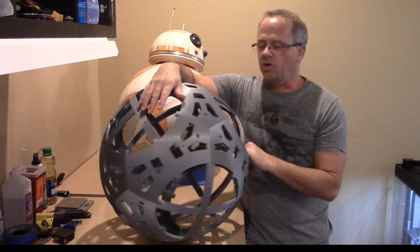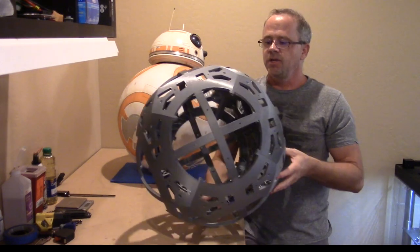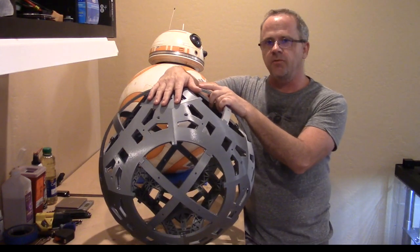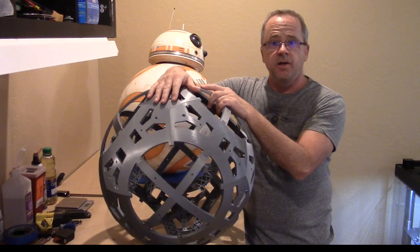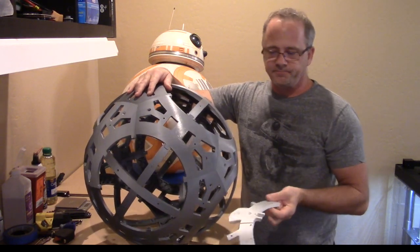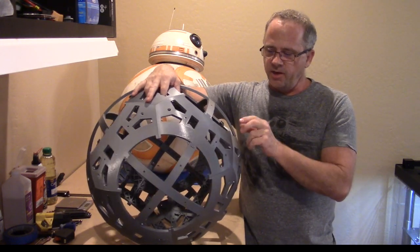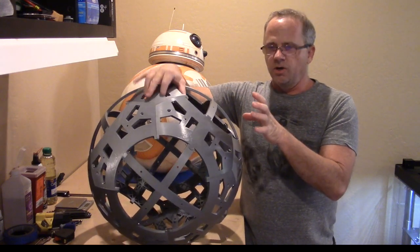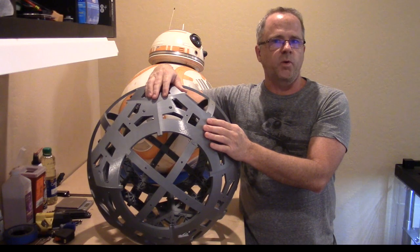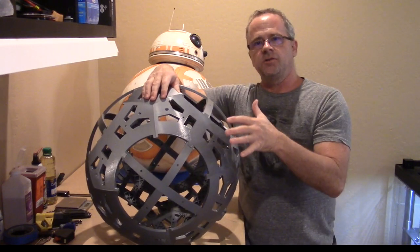This sphere is only 8mm thick, so compared to the old 11mm, it's substantially thinner. It actually weighs quite a bit less. The production sphere, once it's done - the actual sphere portion not including the ribs - is right around 5 pounds. The printable sphere that pretty much everybody's printing right now is around 6 to 6.5 pounds out of PLA. The material this is going to be made out of is a glass fiber injected material. From a strength standpoint, looking at sheer bendability and flexibility, it's probably somewhere in the neighborhood of 30 to 40 times stronger than PLA - so there's almost zero flex. It's extremely strong, and once you add on the different layers it just becomes stronger and stronger.